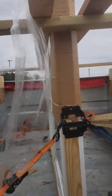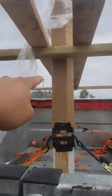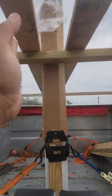Alright guys, so I wanted to pick up this door and travel with it as safe as possible. What I did was I put the 2x4s butting up tight to the frame here, front and back, and I screwed two more 2x4s holding it this way and this way.